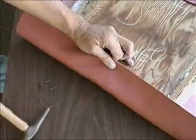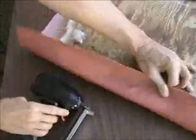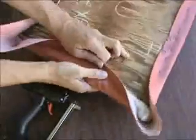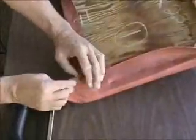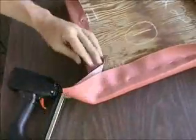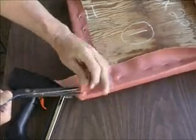Hold up the seat and smooth the new cover and filling down snug towards the back. Staple to one side or the other of your thumb or fingers rather than right in front, which will produce tack pulls. Make sure your work is secure and you use eye protection for your safety. Smooth and staple within 2 or 3 inches of each corner.